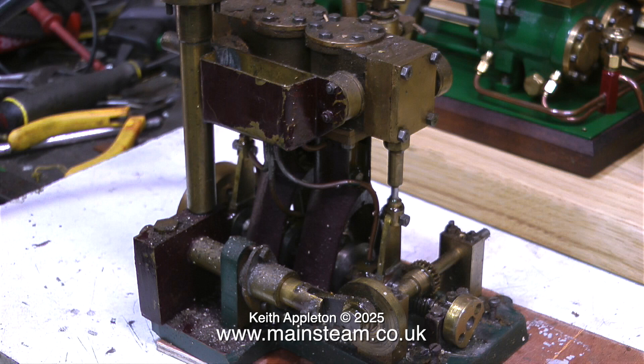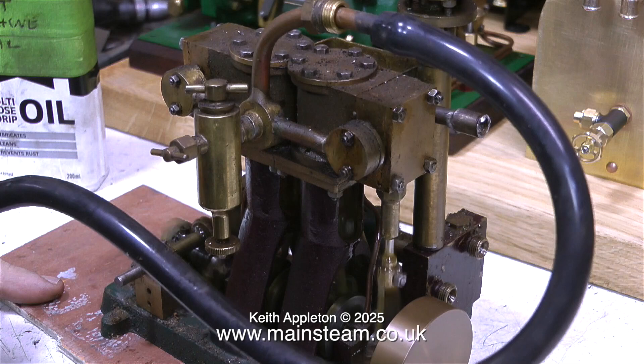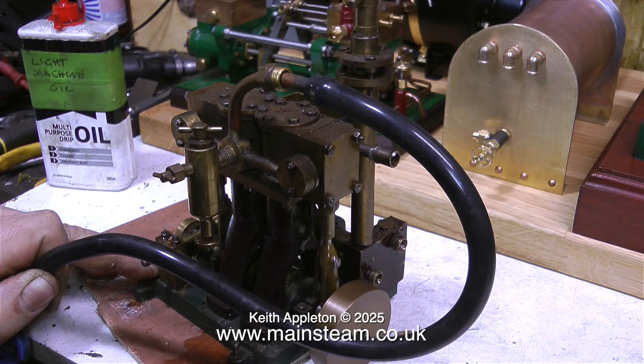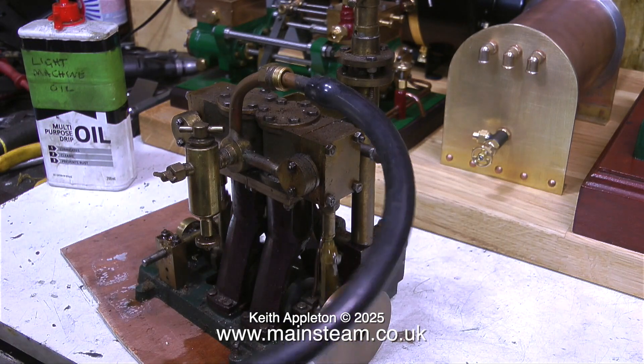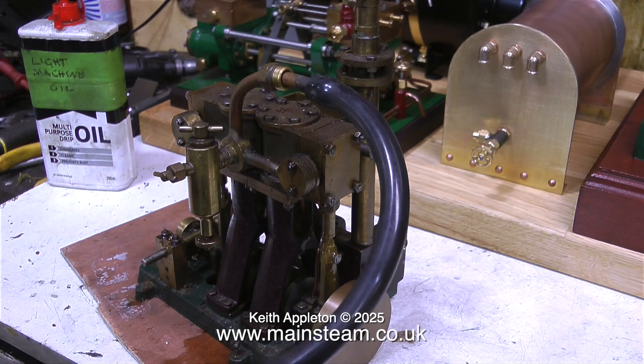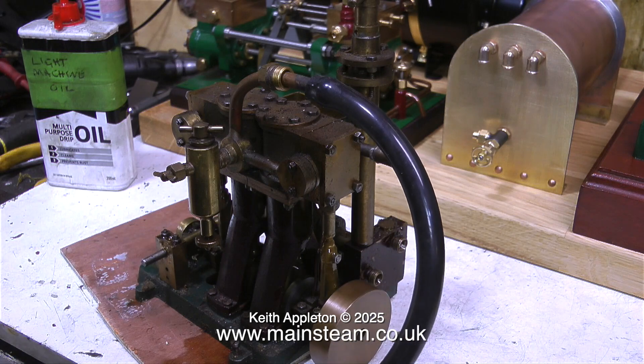First of all I disconnected the airline, then I took the engine into the outer part of the workshop, sat it on the vice, and heated up the cylinders with my blowtorch. By 'heated up' I don't mean I cremated the cylinders — I just warmed them up to about the same temperature they would be if running on steam. Then I put it back on the bench and whilst it was still warm reconnected the airline, and immediately the engine burst into life and ran a lot better. The cylinders were just very gummed up and the oil wasn't getting through — instead of lubricating, it became sticky gum with the residue already in there. By heating up the cylinders everything starts to dissolve, the oil gets through, and now when I put my finger over the end of the exhaust pipe it gets very oily very quickly.